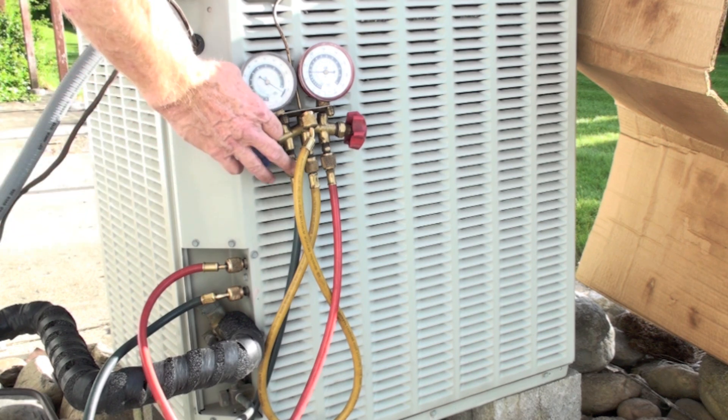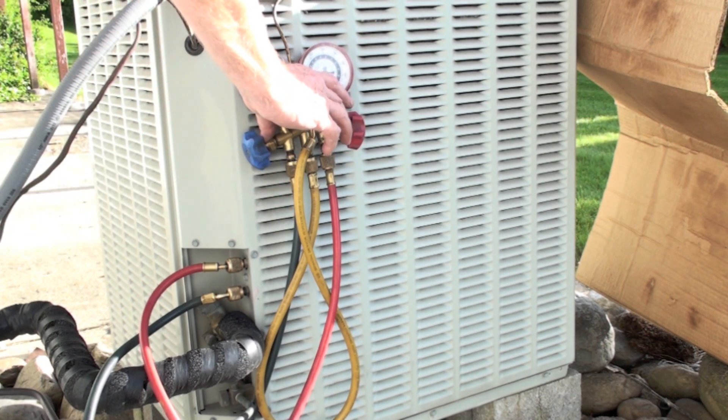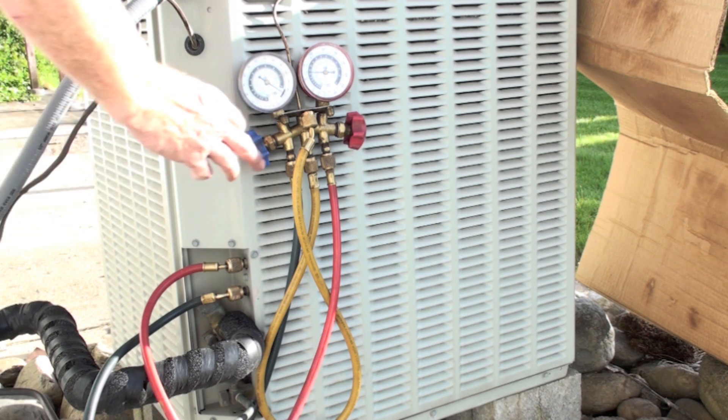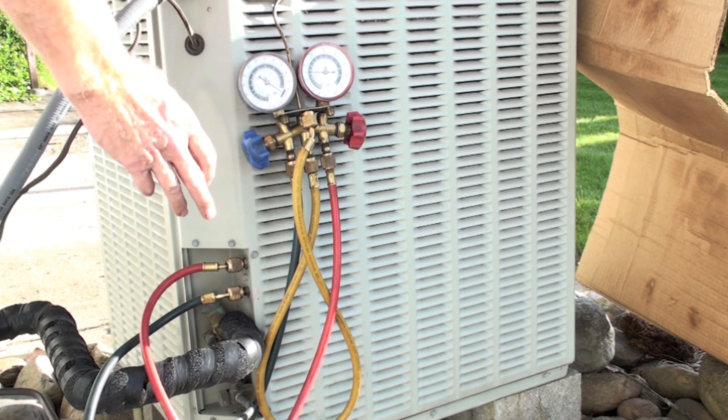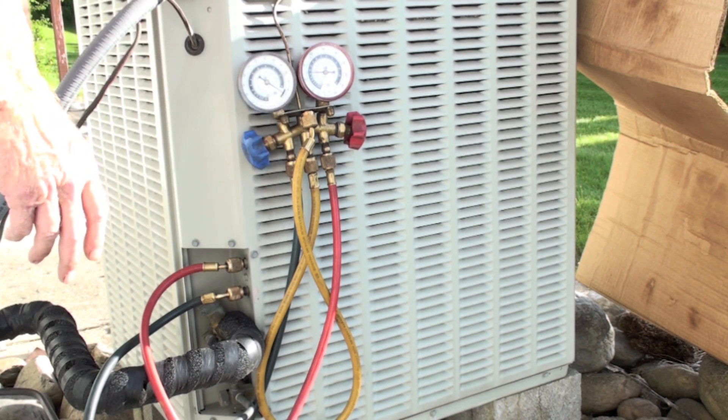What I bled is just these two lines — I haven't bled the body of this. We will show how to do the bleeds on that for different operations later on. Right now you're ready to start and you've got everything bled out. Be sure to bleed these things as soon as you put them on. If you don't bleed them when you put them on, you're going to forget and you'll end up sucking air into the system.